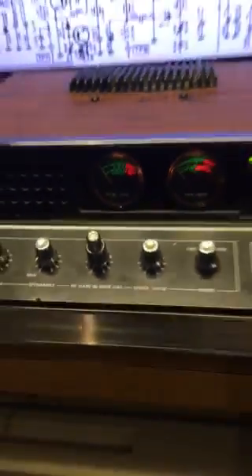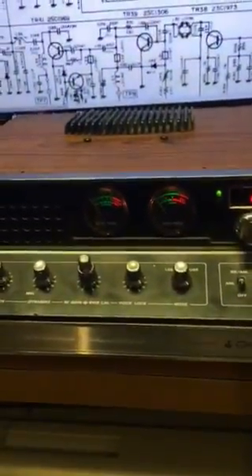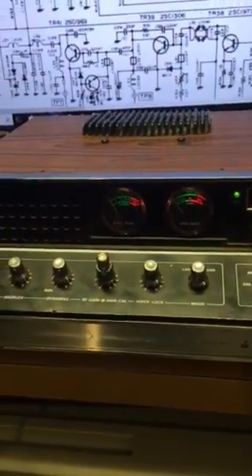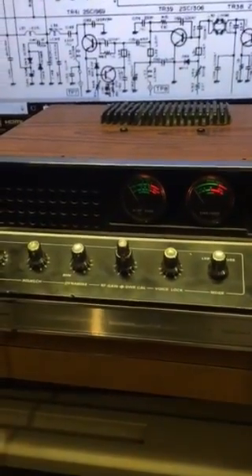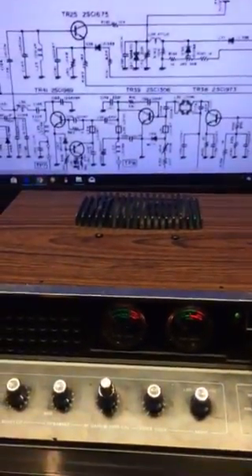Using the existing radio key circuit and adding an additional key circuit to the RF meter - when it sees RF, the system keys up the amplifier. So it's basically a dual keying system. Seems to be working pretty good. Internally it looks like brand new; externally it looks as factory as can be, with the exception of a little heat sink on top.